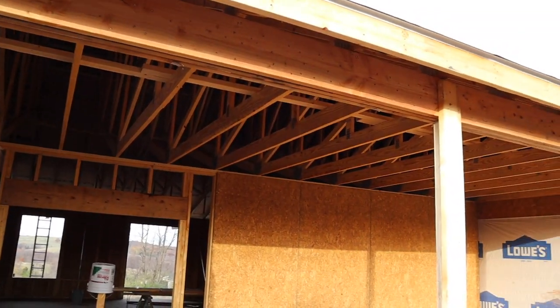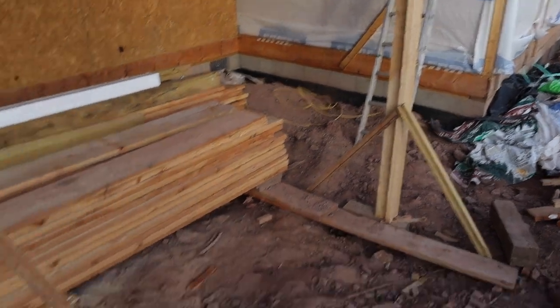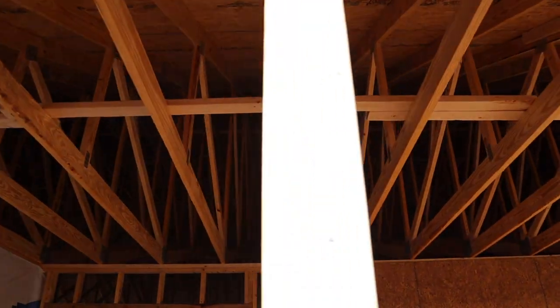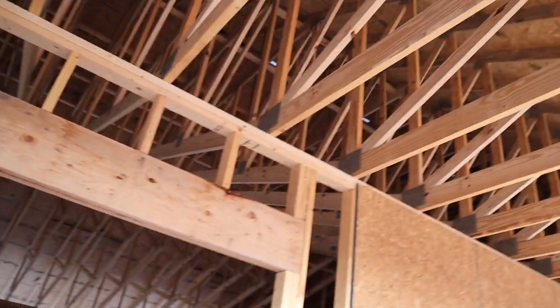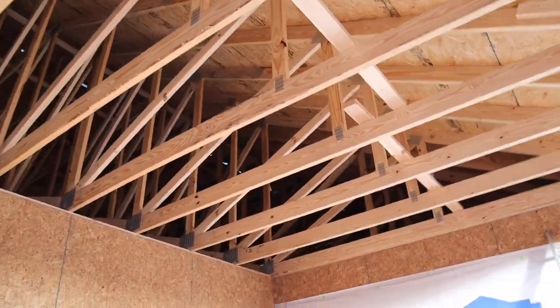After a long day's work you're finished with a nice, beautiful framed porch beam. That's the final product on the rough-framed porch beam. Down here it's sitting on simple temporary blocks — I'm going to be framing up the actual porch in the spring but didn't want to buy material right now. The trusses are cantilevered over 12 feet, so you can get away without a beam for a while, but before they put all the shingles on I figured it'd be smart to put that beam in so we don't break a truss. The truss guy told me to make sure I put the beam in before doing the shingles. That's all there is to framing a porch beam — thanks for watching, comment below with any questions, and I'll see you in the next video!